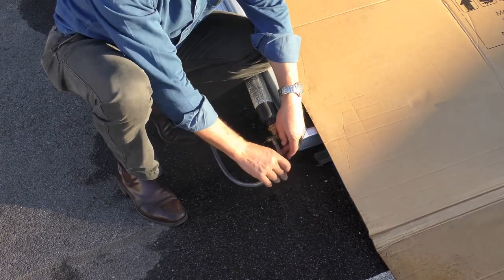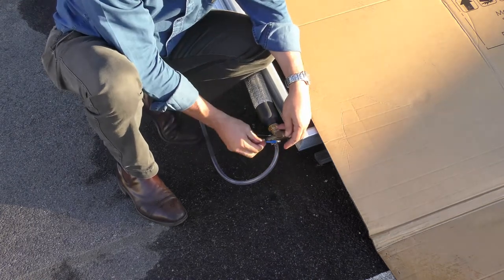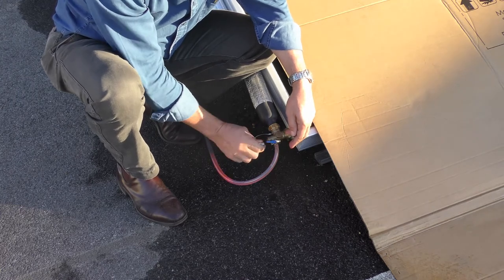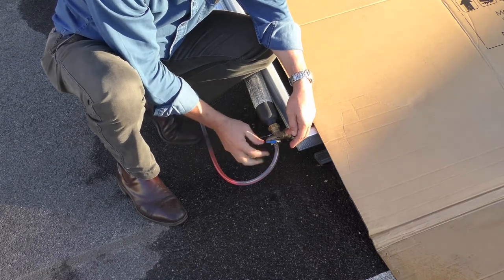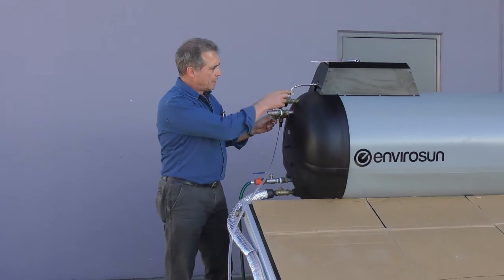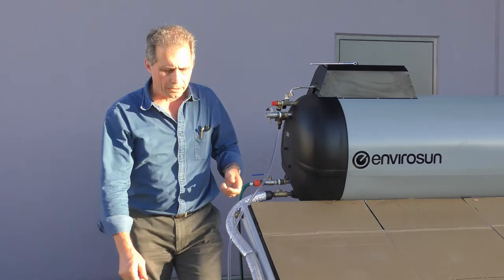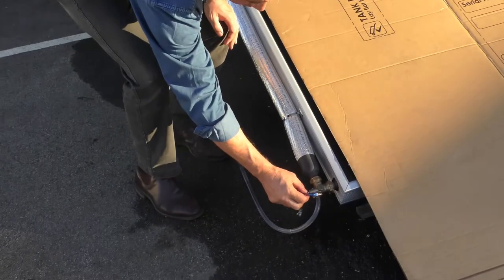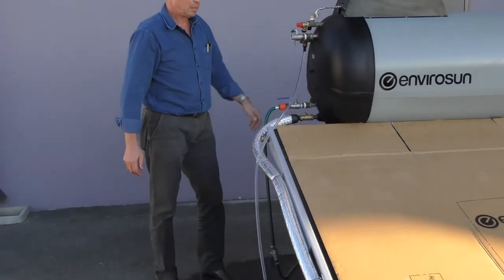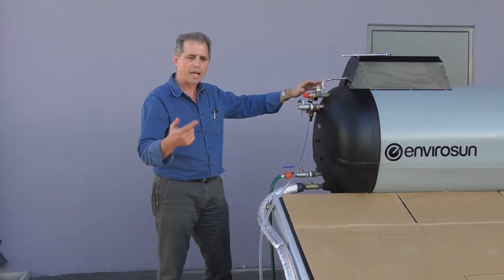This is the correct ratio which will work with our system. Tighten that up and open this up again. You'll see that's starting to run out a bit — that's not a problem. We'll fill that back and push it back up in there now. Your hose is still connected, your fill hose is still connected, your PTR valve — the expansion vessel connection is off here so we're going to have water coming out of there. It's running back up into there now. You can see it's just dribbling out a little bit out the front here. We're going to see a mix of the fluid coming through, and we're starting to see a bit of pink come out of here — and that's how we know that we've mixed it around a little bit.